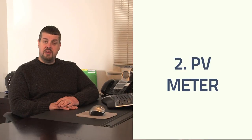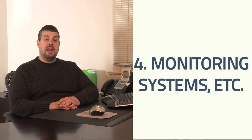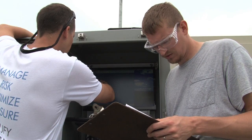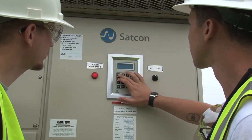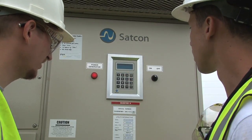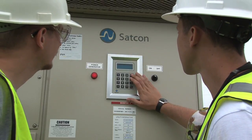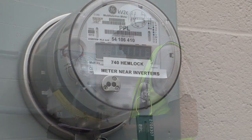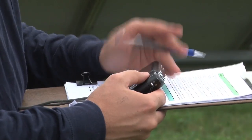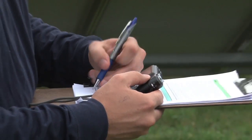A typical solar array may have up to four or five different meters reading output: a utility meter, a PV meter, the metering on the inverter, and any monitoring system among other possibilities. The crews will compare values from these different meters by recording the times they read them, identifying information from the meters, and the kilowatt hours and kilowatts displayed. DC current and voltage are often displayed at the inverter meter. It is not common to open meters up to review internal components, but a crew will look for outward signs of corrosion, cracking, warping, or other physical problems. If necessary, the crew will take pictures and include the required information in the field report.